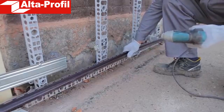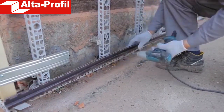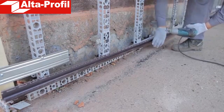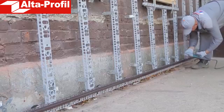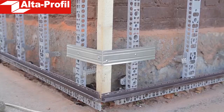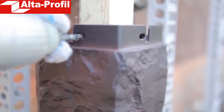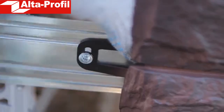If the basement of the building is offset from the wall, first install the panels on the base, and then proceed with finishing the walls. On this house, we decided to visually highlight the base. At the beginning of the work, we fixed a gutter in the lower part of the facade to protect the perimeter walk, and the J profile was installed over the gutter. On the corners of the building, outer corners are installed. It is important to fix them through the hole in the top part. For more reliable corner fixing, use the special side mounts.